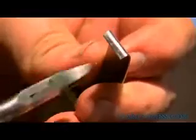Now this will not connect very well unless you bend up the center, and this is difficult. You'll need a good pair of snips to bend this up slightly and down on the sides. If you bend this just like this on all of these clamps, you will find you will have much better success at grabbing the edge of the condiment cup. The edge is round, the clamp is flat, so you have to make some adjustments to grab this edge.